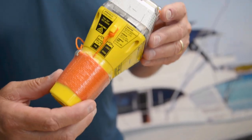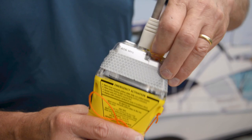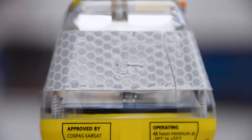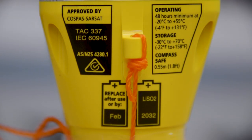The first item we've got is the all-important EPIRB. A couple of things with an EPIRB: you're able to test to see if it's working by a test light on the top. Secondly, EPIRBs do expire and they're not serviceable, so if they're expired you need to purchase a new EPIRB.